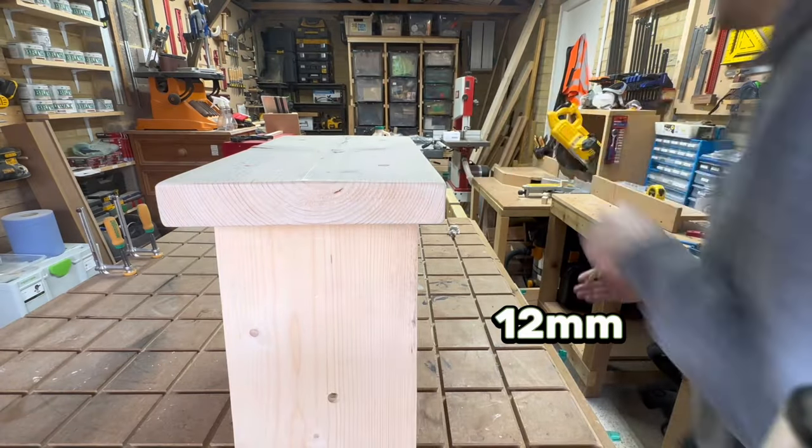Our build is complete. Next up we need to apply the finish to give it that real rustic look. I'm going to use one of my favourites — Briwax Furniture Wax in dark oak, which is a particular favourite of mine. It's a good idea to wear gloves as this gets quite messy, and I use lint-free cloths to apply the wax. I roll out some craft paper to protect my workbench from any wax spillage. Using a circular motion, wipe the wax onto the timber — this gets the wax right into the wood grain and leaves a more consistent finish. Using a second lint-free cloth, I go over the entire stool to wipe off any excess and give it a buff, which gives it the nice sheen you see in the end.